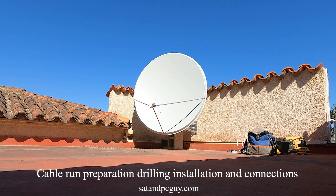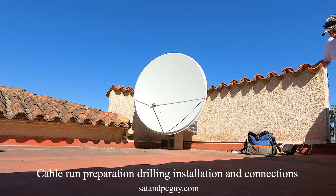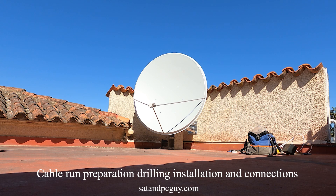Running the cabling can take longer than actually installing the satellite dish. Ideally the cable needs to be installed out of the sun, as the Spanish sun can destroy the cable and cause signal loss and equipment damage should rainwater get into that damaged cable. Although not needed in this case as the cable runs along the back wall and out of the sun, if the cable run is to be in the sun, a protective tubing is preferred to help protect the cable from the sun.